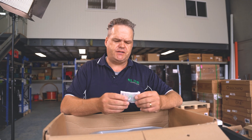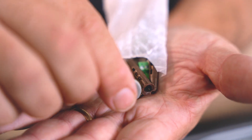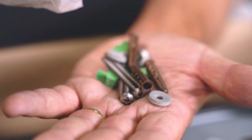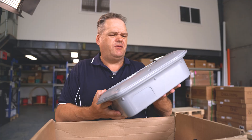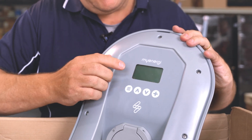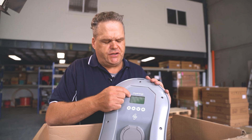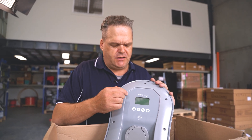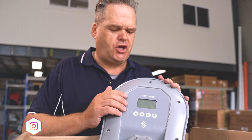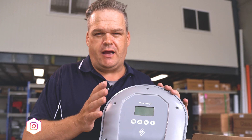There's also a pack of screws, and what's interesting is the washers have some insulation on the back, so it maintains its IP65 rating — it's waterproof. It's probably only three or four kilos, and it has an LCD panel with a readout. On the panel, you get to see what energy you're producing and where the Zappi is pulling its power from — whether it's from solar you're producing yourself or from the grid. There's a boost mode so it will charge at full speed whenever you want a quick charge into your vehicle.